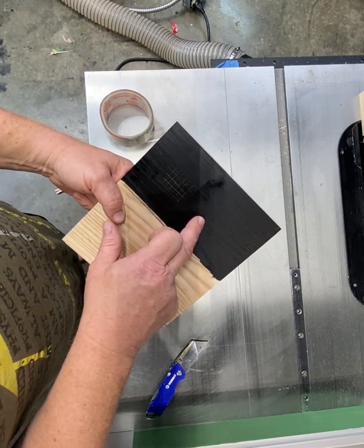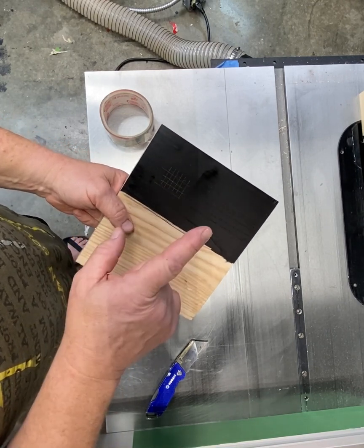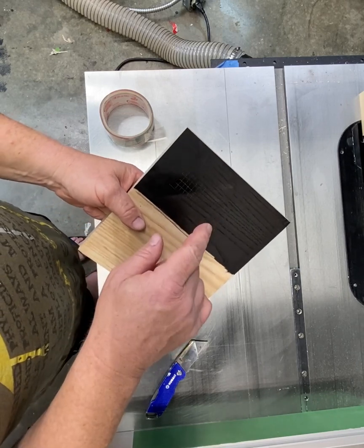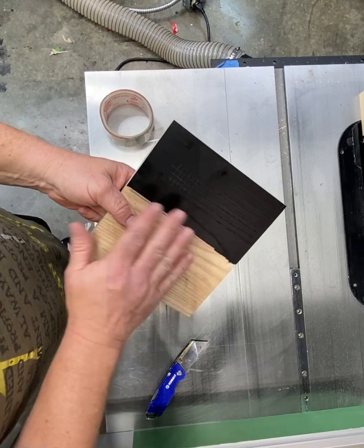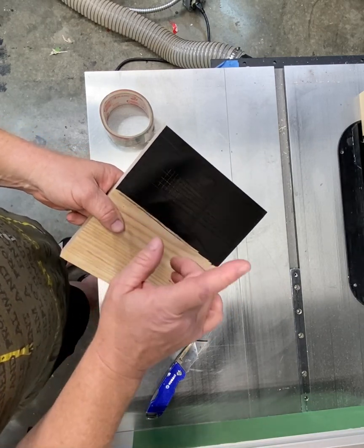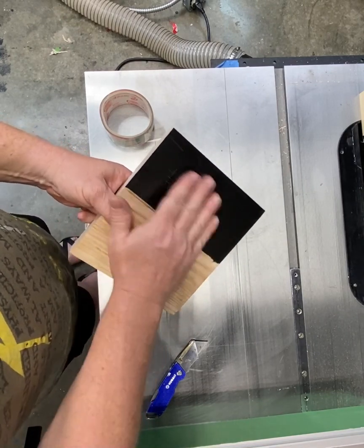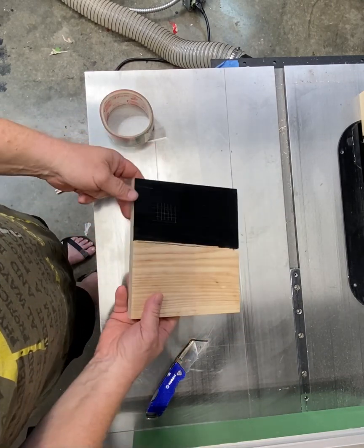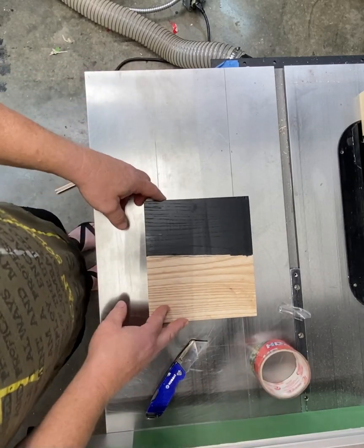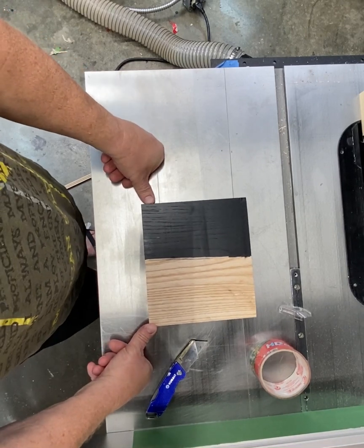This piece was done with Indian ink and the matte Minwax polyacrylic. I finished bedroom furniture in black Indian ink at a three-to-one ratio with General Finishes Satin High Performance. I didn't pre-stain — I sprayed right on the bare wood, three coats, using four-ought synthetic steel wool between coats to scuff up the surface for the next coat to adhere. It came out really nice.